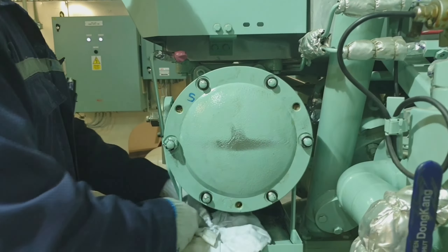When the generator is in operation, one of the most important parameters we have to check every day is the lube oil pressure of the engine. Based on our observation and the changes of the differential pressure, we have to decide when to replace the filter. When it has come to its alarm limit — the differential pressure high, which is set to 1.5 bar — then it's time to replace the lube oil duplex filter.